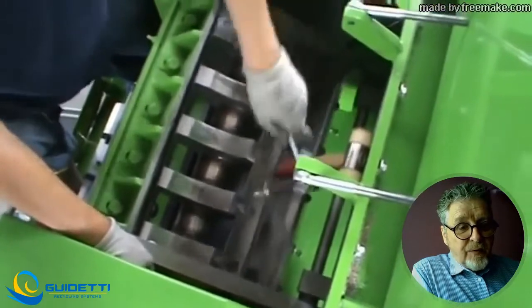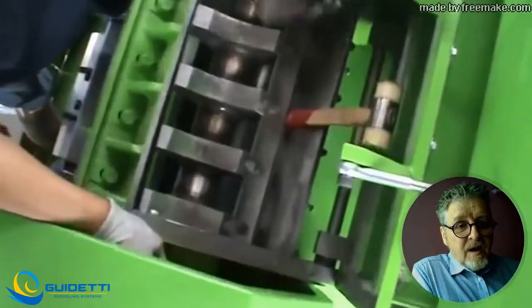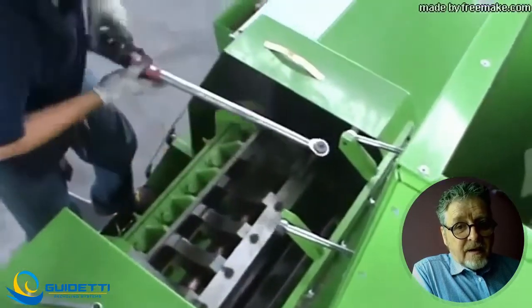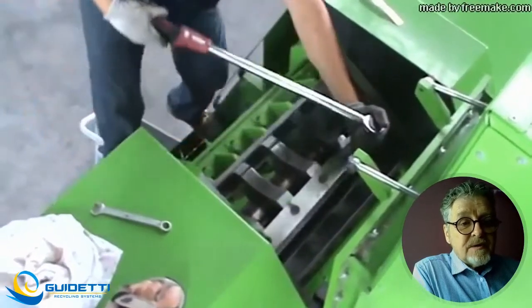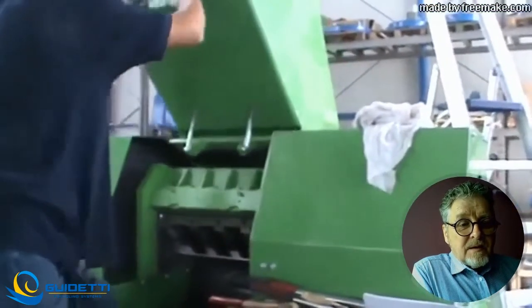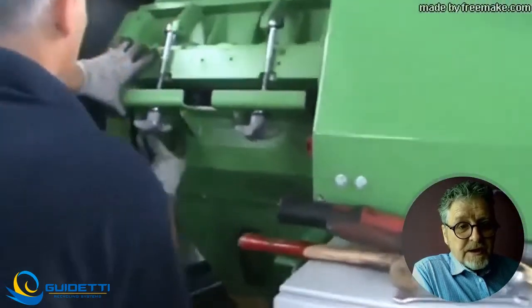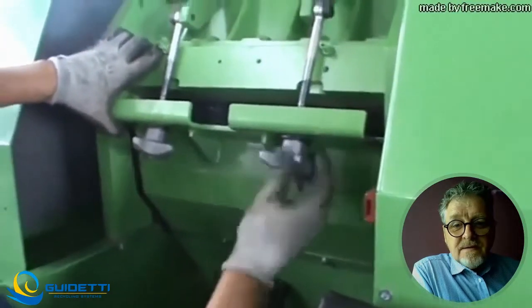Now you can close and fix the knives — the bolts of the stator knife can be closed fully. The registration is done and the machine is ready to be used. As mentioned before, this operation may need to be done often depending on the quality of your cable. Now close the machine again by bending the dosing hopper back to the front. Lift up the support for the grinding grid and close it, making sure the grid is perfectly fitted in the support. Close your machine and you can start. Enjoy your work and have a nice job — welcome back.